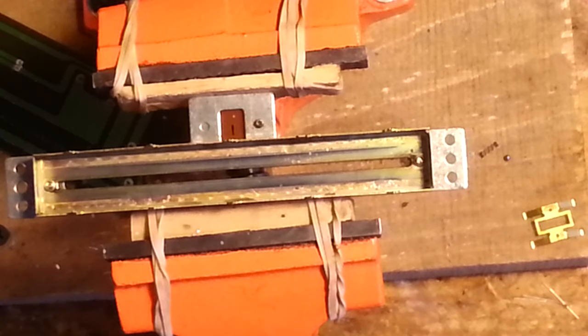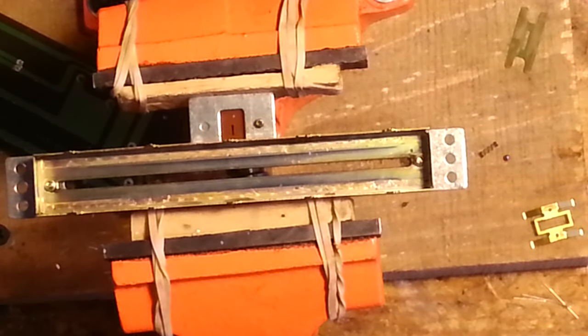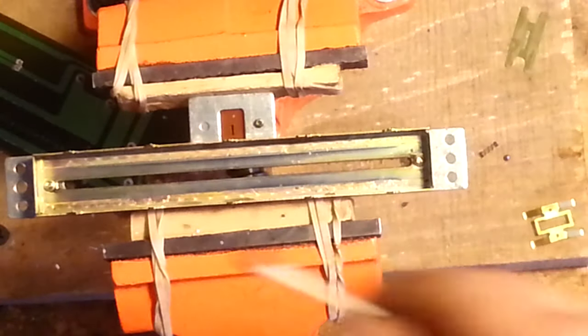This is the little spring tab for our fader — we're going to put that aside. And this is just a little dust cover plate that keeps dirt and grime from getting on the spring tab. I'm going to put a little bit of contact cleaner on the rag here. You can also use isopropyl alcohol, which is nice for cleaning — I actually usually prefer that because it's a lot less expensive. So for the inside of this we're going to clean it with a little bit of alcohol.